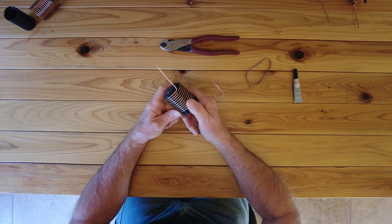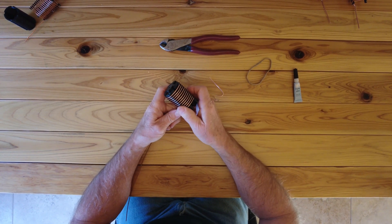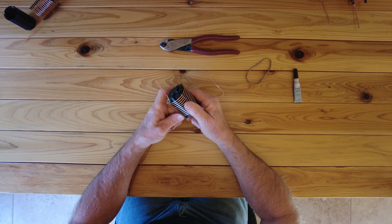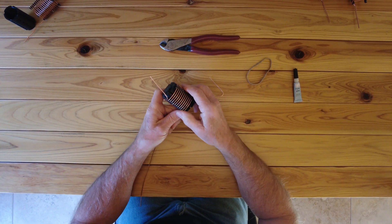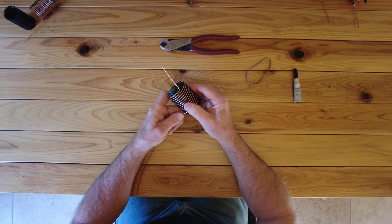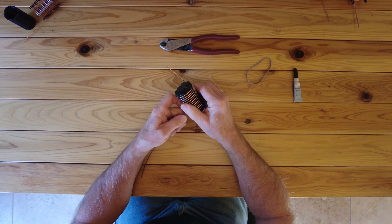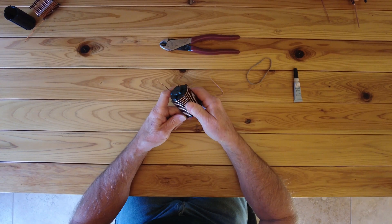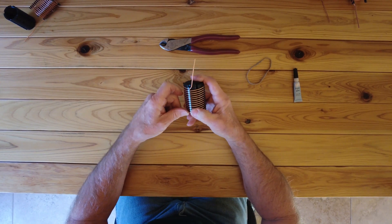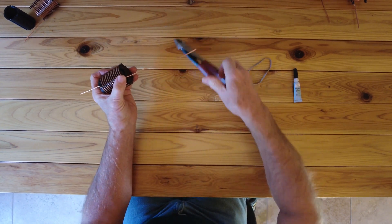This particular set of strips was set up for 12 turns, 6 turns per inch. The interior form length I picked to match the number of turns and turns per inch I chose, and the diameter was set at 50mm. Okay, we're at the end — we'll put another bend in that and trim it a little bit.